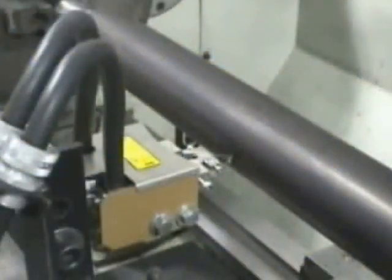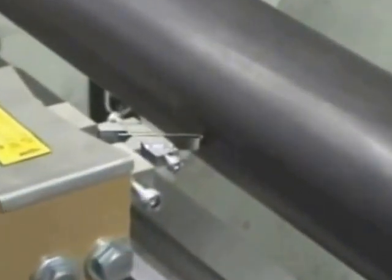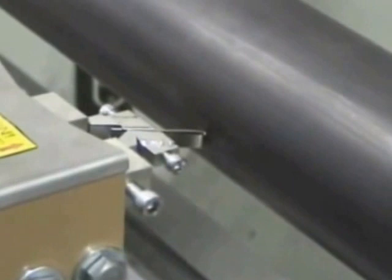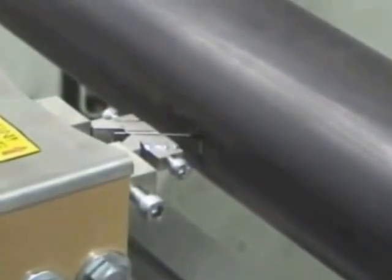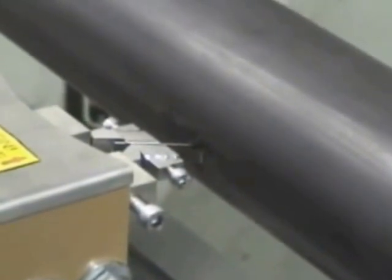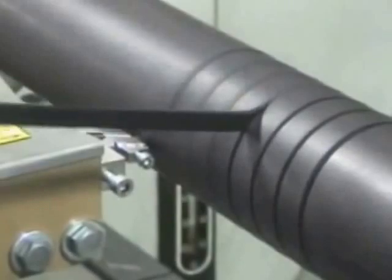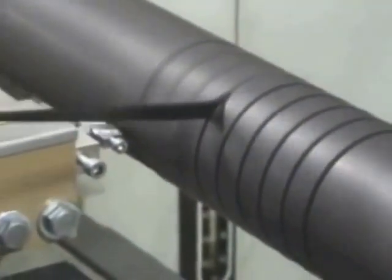Another example of how versatile and useful the Elastomer cutting system is can be demonstrated with how easy it is to produce a flex spreader groove using just a standard engine lathe. The flex spreader cutting fixture has a 30-degree undercut angle built in so it always produces the correct undercut. As with other cutting operations, making the spreader groove is quick and clean.